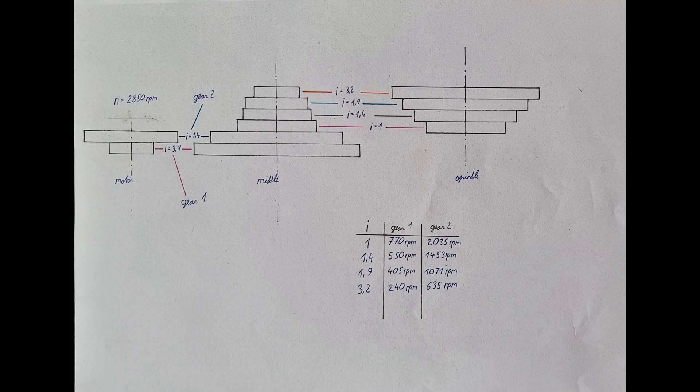That's about all you can do there. Now between the tensioning pulley and the spindle pulley you can select the spindle speeds. On each step of the cone pulleys there are always two spindle speeds available. Which one gets used depends on whether the high or the low gear is engaged. If you take a look at this table you can see all spindle speeds this mill is capable of.